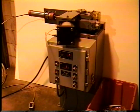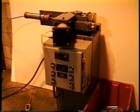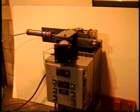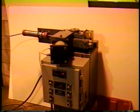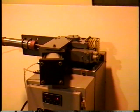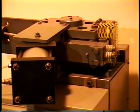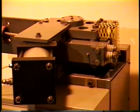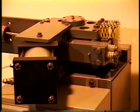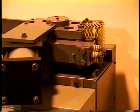That is a conventional Apogee rod feeder — we have dozens out in the field operating quite satisfactorily. What we did was modify it with an air cylinder and manipulate our swing arm, which typically would be a static device on a conventional rod feeder, such that we can interrupt the compressive forces — the pinch forces — on the rod, and therefore terminate the feeding action of the rod, and at that point coordinate that with the actual cleavage or chopping of the rod.